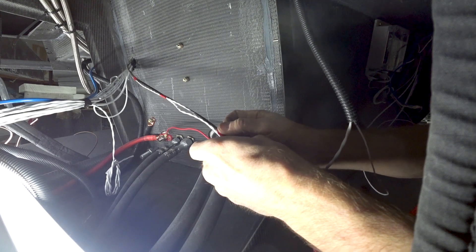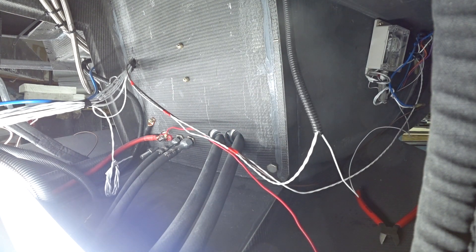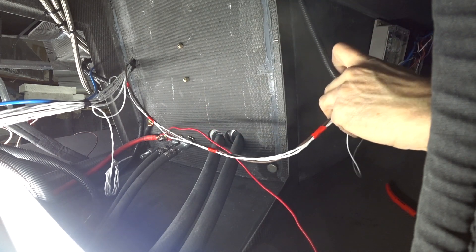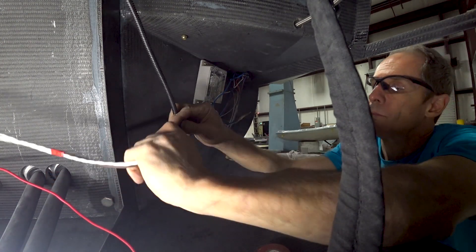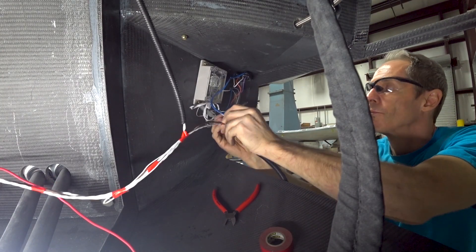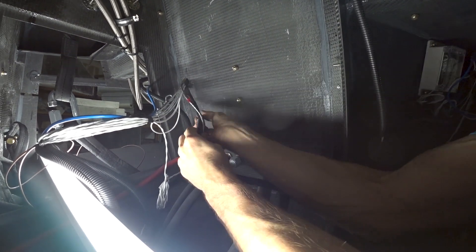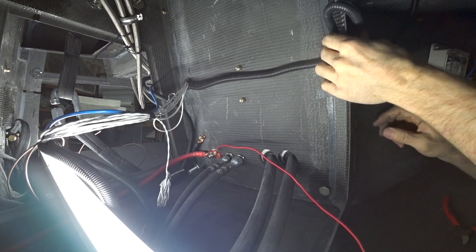Back in the baggage compartment, I've got the task of grouping the wires that came across - the power wire and a couple of sensor wires from one of the pressure gauges up in the engine. I'm putting a little bit of electrical tape to keep those together, then putting some split loom spaghetti around there - that black stuff you can see on the top bit. That strap hanging down is one of the parachute straps that anchors down on the gear and goes up through the roof compartment area. The bundling went on pretty easily - probably the easiest I've ever had it. I'll probably add some mounting tabs on the wall with adel clamps just to hold it in place tidily.